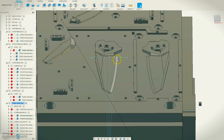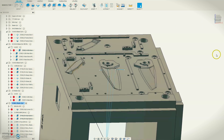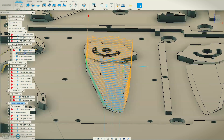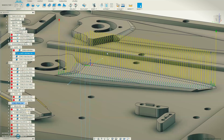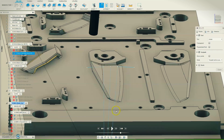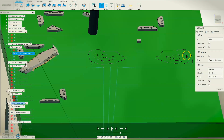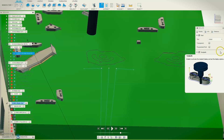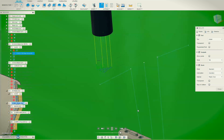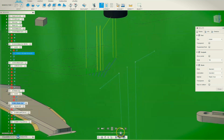If you look here I'll just go a little bit into the blade and how it's machined. So if we zoom in here, the first operation is what's called a roughing operation. These blue and yellow lines are the machining lines. So if we simulate that just now, put stock on so that simulates stock — it looks like the whole thing's submerged in material but it doesn't really matter. So if we play this and zoom in, you'll see it's not actually cutting anything initially — it's floating in the air. It'll start doing a cut here.